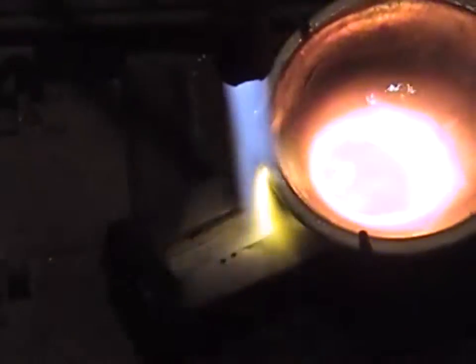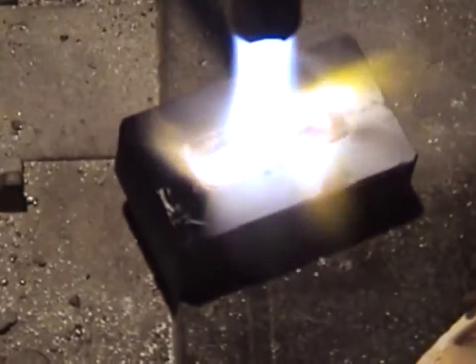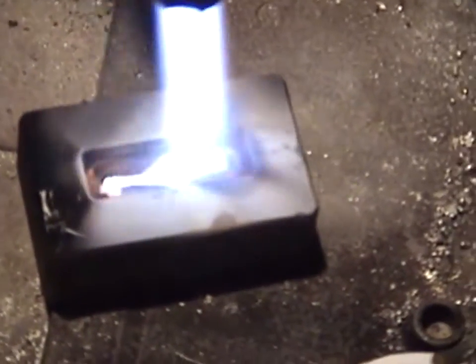If you want to know the difference between your flame settings and your silver, you can see as I adjust this flame how the surface of the silver reacts to it. I think I'm about to run out of gas — maybe I can finish shooting this video. You want to move the silver around in the dish, again heating the tip. As you warm the graphite mold, tip it up into your mold and hold your flame on it as you allow it to cool. That will stop the surface from having any oxygen trying to escape and leads to a smoother finish. And again, our bar — you can see how shiny and pretty that is. Another piece of flux hung on there but we'll get that off in a bit.